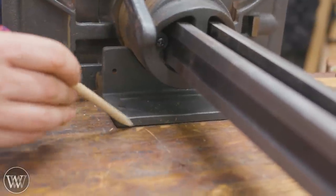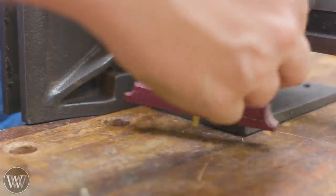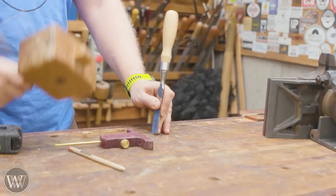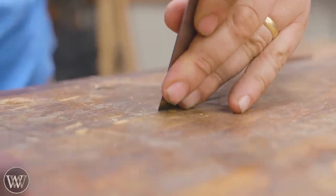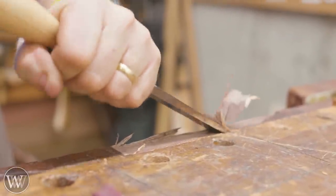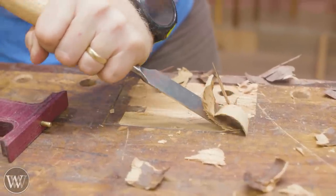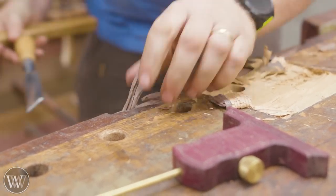To start, we're going to flip this thing upside down and mark out its footprint. I'm going to start with the back, which is the thinnest point, so I can take all of this down to that thickness. I don't really like chopping into my bench, but I guess I'm going to have to. We're going to run around this outline and take this down about a quarter inch. We'll chop out the waste, come back in and cut a stop cut on the outside edge, and go back and do it again - thicker and deeper.